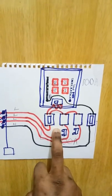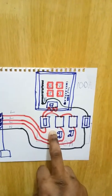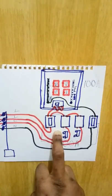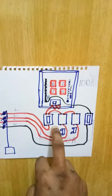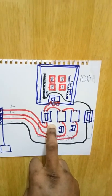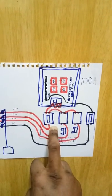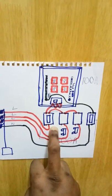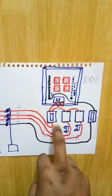But if you are going to have a lot of air conditioning, a lot of washing machines, and a lot of water heaters, you upgrade to 200 amps. For this demonstration we use a 100-amp fuse — four in number. Cutout fuses used to be plastic, but today there are ceramic cutout fuses.